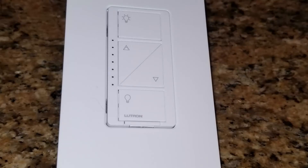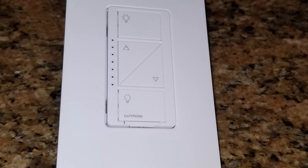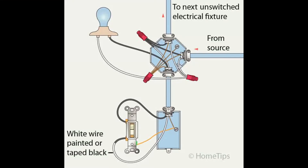The Caseta is a great switch — it's a way to install a smart switch if you don't have that dedicated neutral wire, which a lot of houses from the 80s and 90s don't have. A switch loop is no longer up to code, so a lot of newer houses won't have this issue, but many older houses still have this setup and people find they can't get their new smart switch working. In that case, you really need something with a hub that does not require a neutral wire, and the Lutron Caseta is one of those options. It works really well, it's responsive, and it's easy to install and use. Thank you for watching — I hope you found this useful. Leave a comment, leave a like, check out my channel, and we'll see you on the next video.